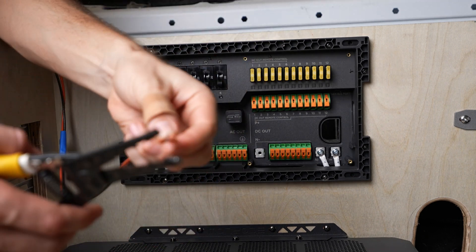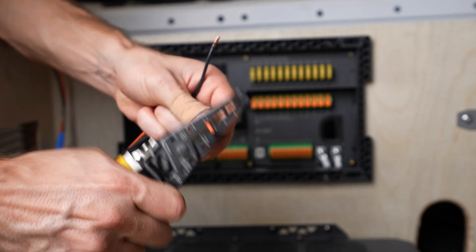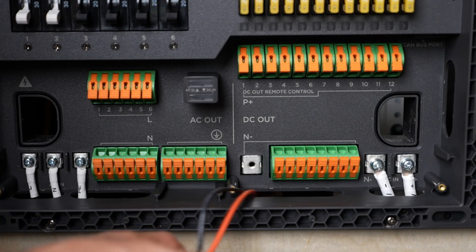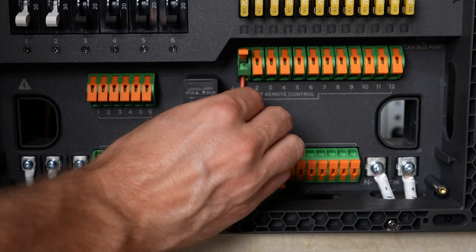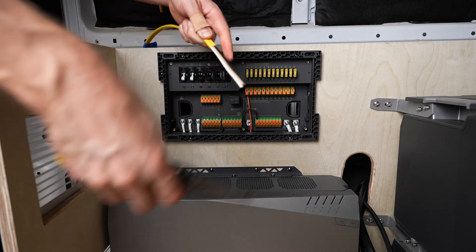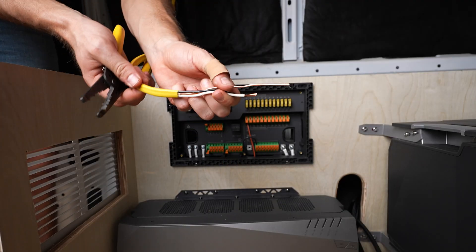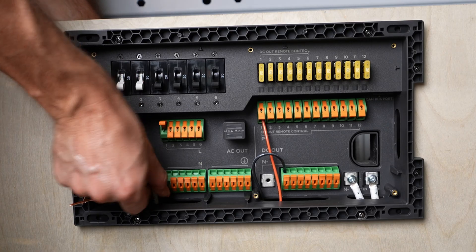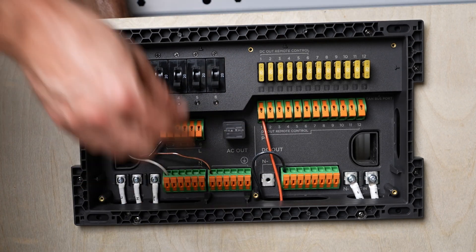Here's how to wire a 12 volt device to the DC connections on this panel. These are the wires that go to the MaxAir fan in this build. Strip off about half an inch of insulation and then open the clamp connector. Then you just stick the wire in and close it. Same concept here for the AC wires — these are the wires that go to the air conditioner in the van. Quick tip on these wires: cut them so that the ground wire is longer than the hot and neutral so you can route all of them easier. I'm connecting these to the white 30 amp circuit breaker since the air conditioner will draw so much power.